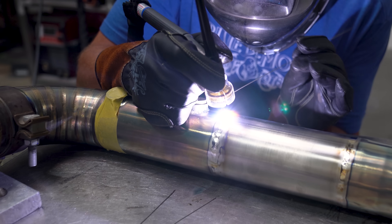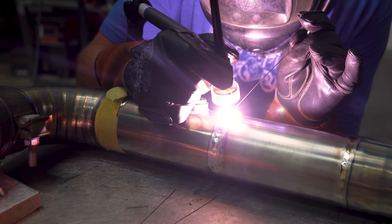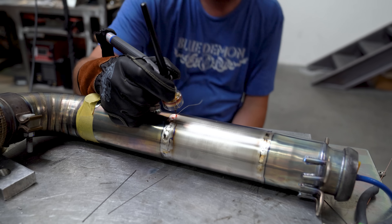Welding titanium is really tricky for beginners because it's a metal like no other — it really has nothing to compare to. Its most famous characteristic is that it is sticky, usually defeated with a change in technique, but ultimately nothing beats constant practice. My technique usually involves stabbing the pool instead of letting the titanium wick or flow like in normal welding. The stabbing technique requires a slightly elevated wire position and near dead-on accuracy.